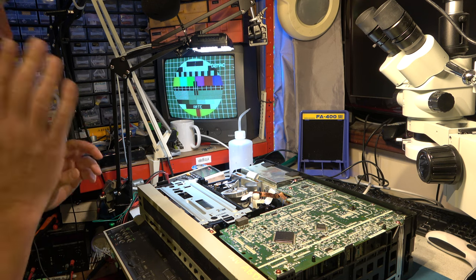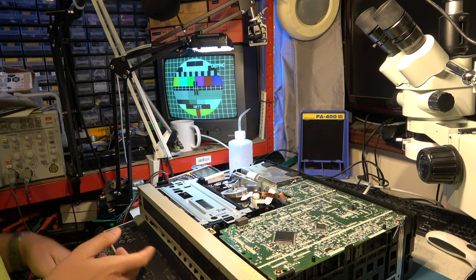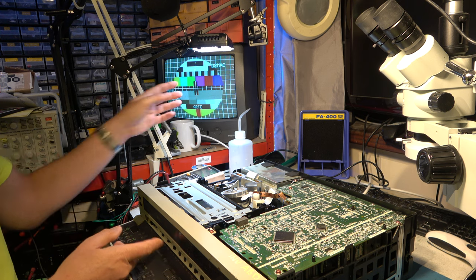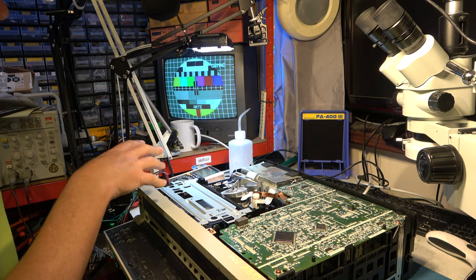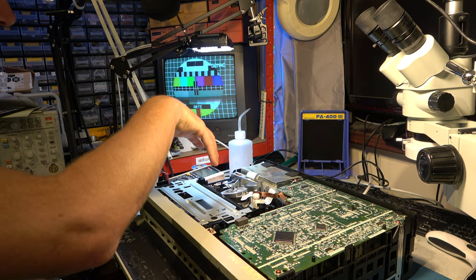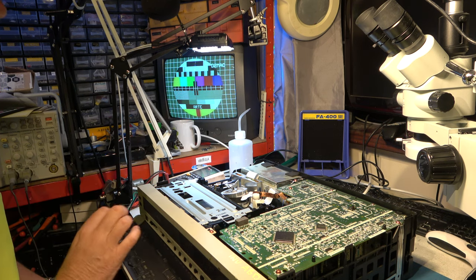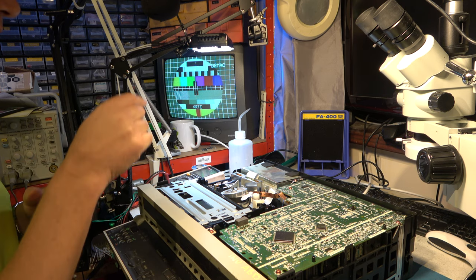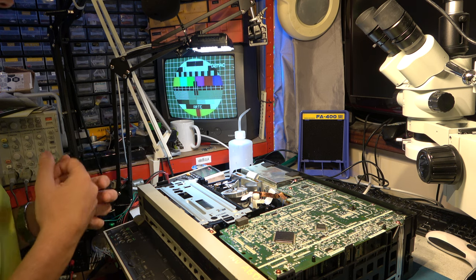But I can hear a very slight sound to it. And if I switch the TBC off, there's a little shimmer. And you know what shimmer means, don't you? Horizontal shimmer. Very often that means that the head speed is changing very, very slightly in each revolution. But of course, with the TBC on, it retimes it. Doesn't matter. What's causing that? Probably that little bit of contamination that's going around, and it's touching the tape and slowing it down.